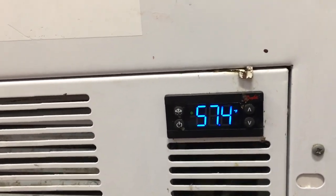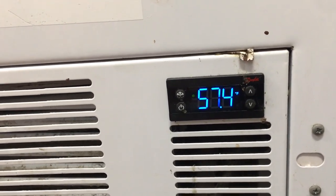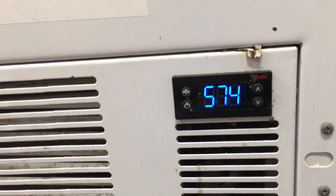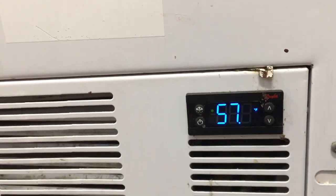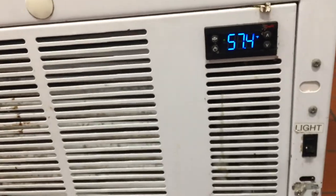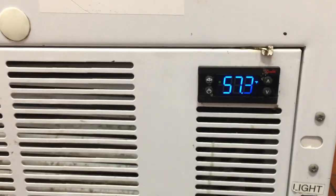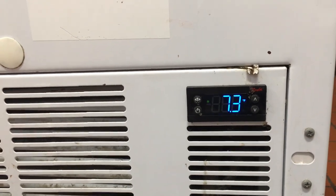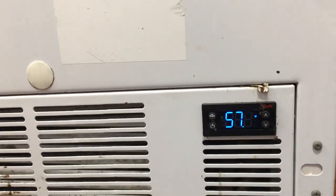We're coming down, going in the right direction, but we're running just a couple of minutes, maybe two minutes at 58. It might be the time delay - I'm going to make sure I set that time delay for five minutes. It might have just short-cycled. So I'm going to change that, clean the condenser, pull the unit out and check the electrical box. Since it's running and it is cooling, I'll run it for 15 minutes while I get my stuff to clean the condenser.